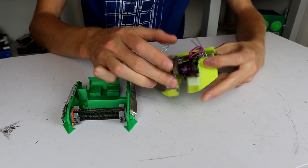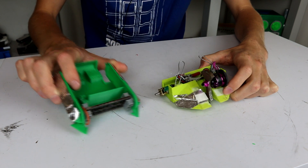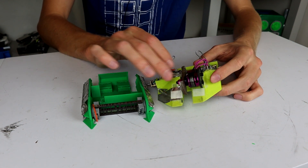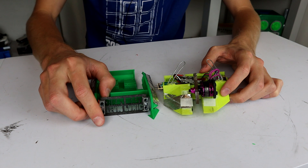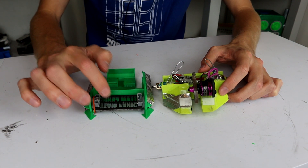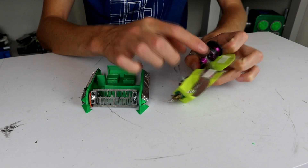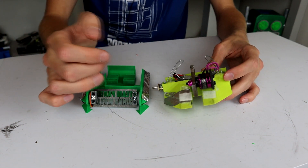Most noticeably we're going to be moving over the bigger weapon motor. I don't actually have the original weapon motor still in Don't Need Rhodes, but it was tiny in comparison to these 1806s that I've used in This is a Party. I also used to run a belt drive - you can see the rubber band on this side - and I think it actually led to a lack of power. So I want a better system for transferring energy out to the drum. In This is a Party we used a direct drive system which worked really, really well and transferred a lot of energy.